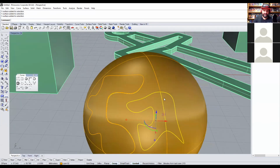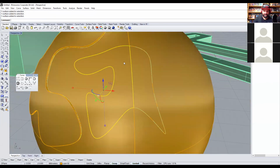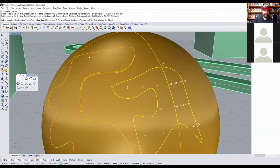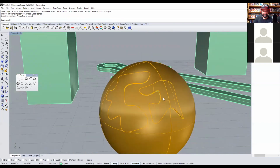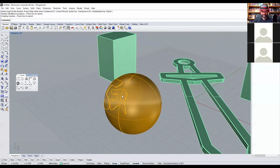Now you see, look where I split here, you see the seam that Rhino made in order to make the sphere. So in order to do that command that I did before, you would have to join these together first. So I would hold left click, hold shift, left click the other one and hit the puzzle piece. And now it's joined. So now when I offset it, surface, offset surface, again solid, and let's make a greater distance, 0.5. So probably 0.5 would be better for this particular design, for this size. But this is a huge sphere I made. It's kind of big.